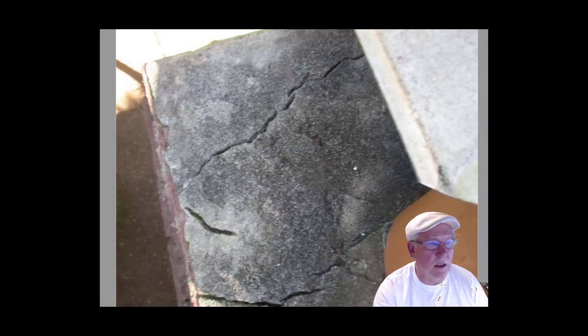There are cracks in the concrete crown. This is the flue liner sticking up, and this is cracks. This chimney — the crown needs to be repaired. That's something that definitely needs to be done.